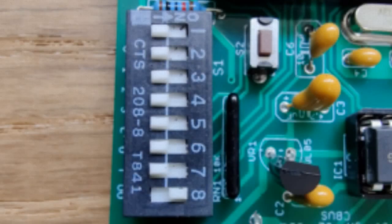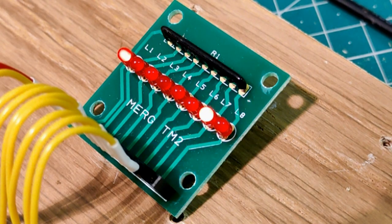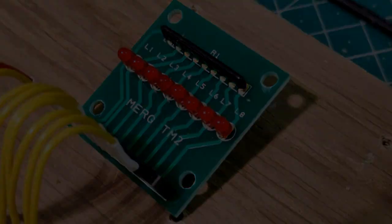It is possible to configure the CANINP so that it only produces on events. These can be useful for route setting. Alternatively, you can configure CANINP to operate in toggle mode. This is useful if push button switches are attached to the inputs. One push produces an on event, and the next push produces the off event, and so on.